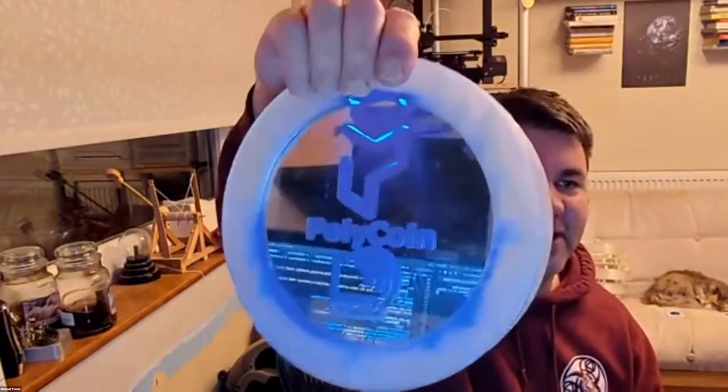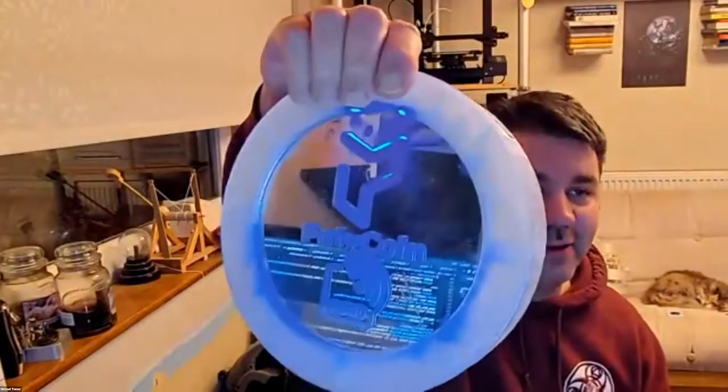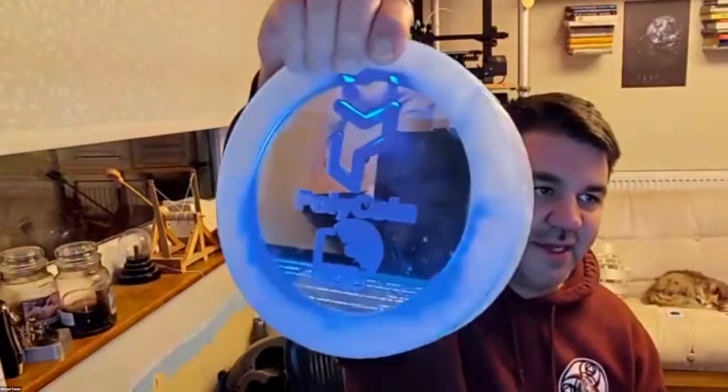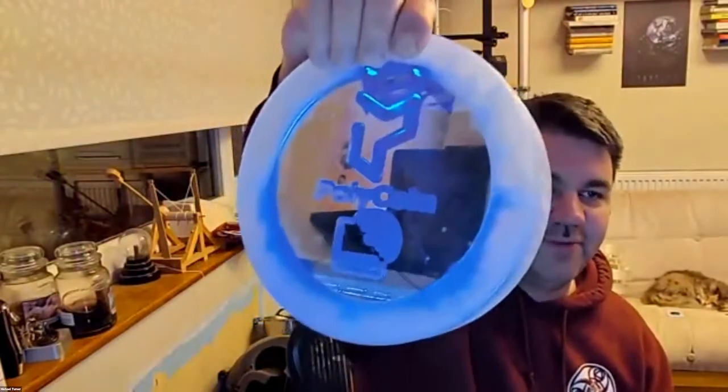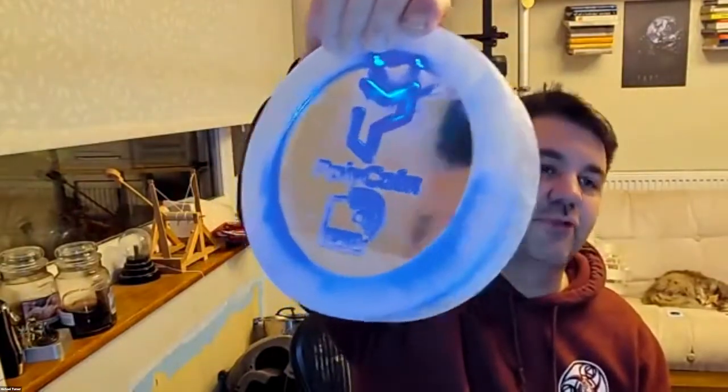And each time, what it does is it turns the NeoPixel strip on using a MOSFET, and then sends the LED data through. And when it's finished, it turns off the MOSFET. That way the NeoPixel strip is not drawing any power when it's not actually turned on, because the NeoPixels have about a milliamp current draw when they're idle. So effectively, when you've got 7 NeoPixels sat there doing nothing, that's 7 milliamps of power that you're throwing away. So I didn't want that.